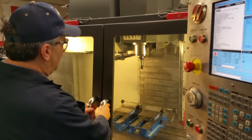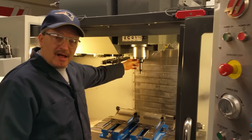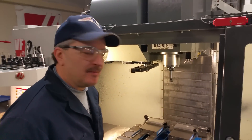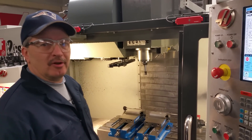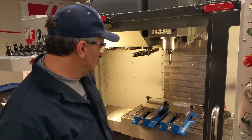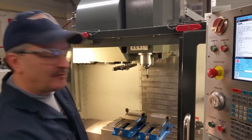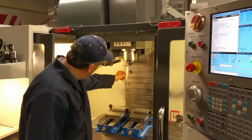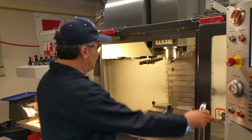This is our new 1 inch cutter. It's hanging out of the tool holder quite a bit — I don't want to cut it yet until we prove out the cutter and make sure it's good. I expect a lot of noise and a little bit of vibration. But as long as it's going to do what we expect, we'll cut it off and get it sticking out maybe an inch and a half or two inches. Right now it's about three and three quarter inches out of the hole.